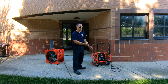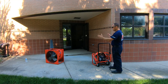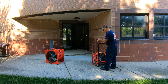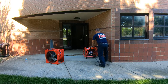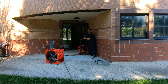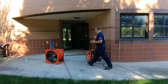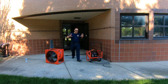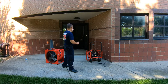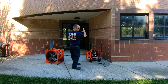The first thing we do is set up a single fan. On a single fan setup, we want to ensure the fan is positioned — either directly in front of the door or at an angle — so that the cone of air covers that entire opening. We don't want the fan too close, because then you're only getting about half the doorway covered. Find the right distance so that as you walk to the door opening, you can feel that cone covering the entire opening, truly pushing all the air through and not allowing bilateral flow.